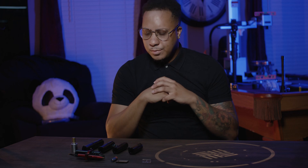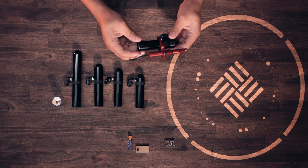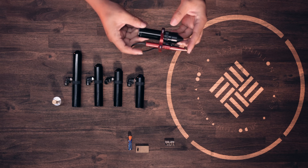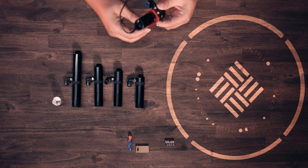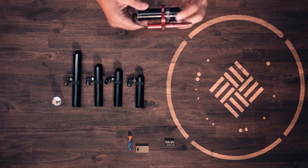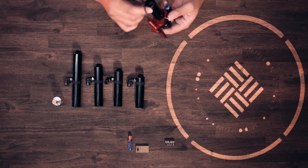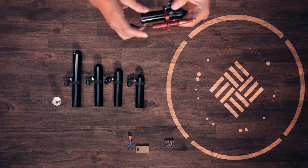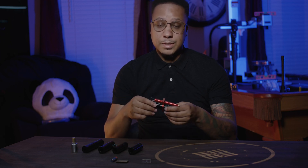Let's start off with what comes with your machine. You probably have something like this, which is your typical stock setup autofocus pin type thing. It probably comes with a two-inch lens like this one did. Two-inch lenses are great — they've got a decent amount of reach and you can cut a lot of things with them. It's pretty much an all-around go-to lens. It engraves pretty well, leaves a lot of detail, cuts pretty good, marks great.